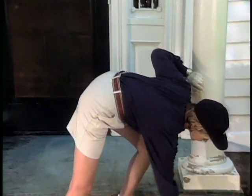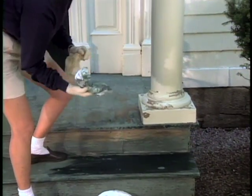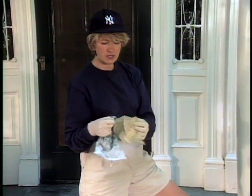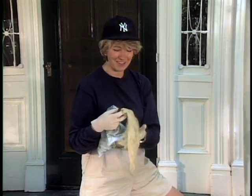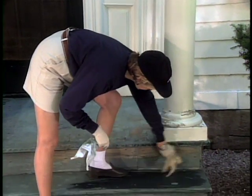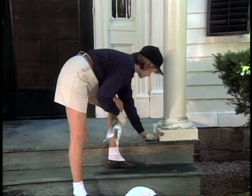Once you finish the sanding, it's time to get rid of all the dust before you paint. Use a very lightly damp cloth to pick up the first batch of dust — you'll see how much green dust you pick up. Look at that, unbelievable. Let that dry, and then use a tack cloth, which you can buy at a paint store. It's sort of like an oily cheesecloth — very tacky, that's the name. Keep those rubber gloves on your hands, then just wipe up. This picks up the last bit of paint dust.